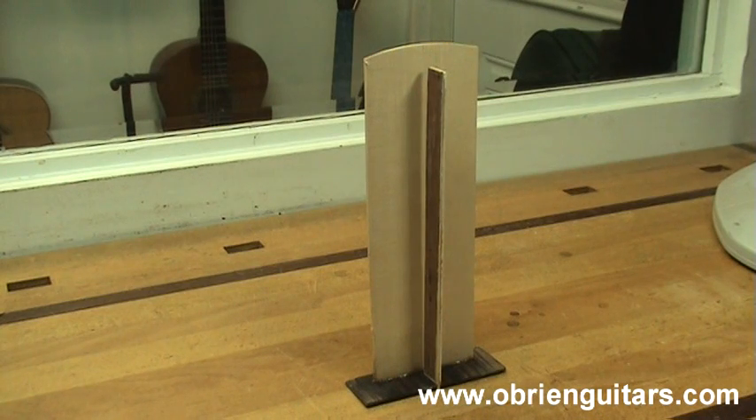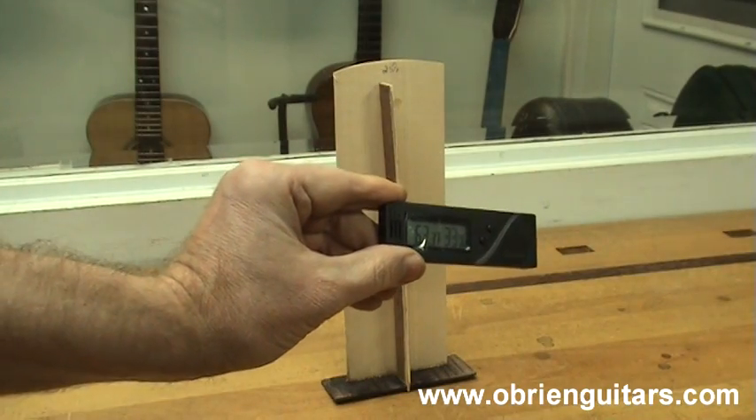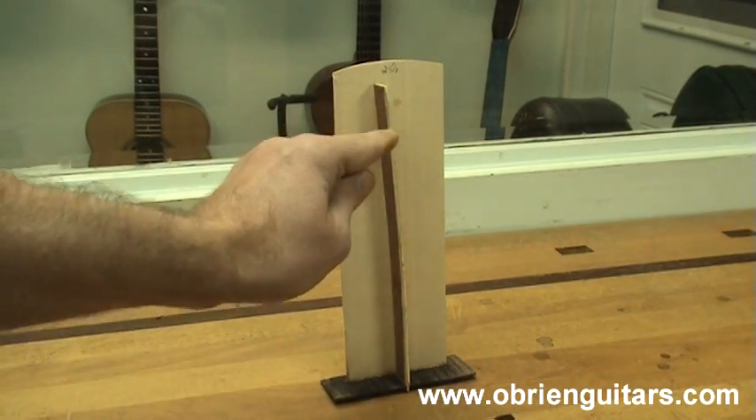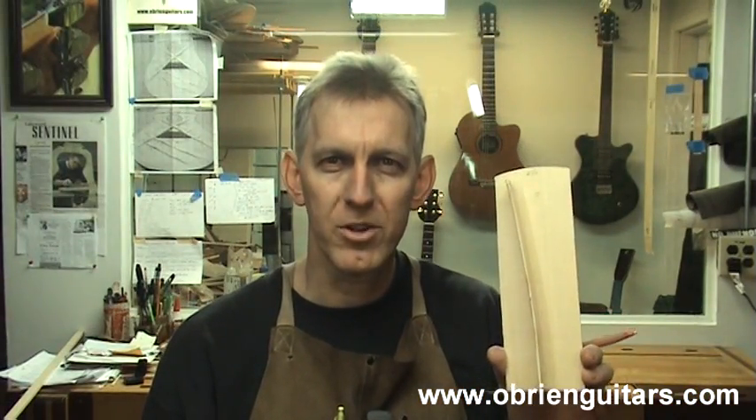If you wanted to, you could even make yourself a little stand to help hold your hygrometer. If you have a hygrometer in your shop, you can even use that to calibrate your homemade hygrometer by making marks on the stand. So this little tool could become one of the most important tools in your shop — it will help you know if there's a change in relative humidity. Take a look at your homemade hygrometer when you join your backs, brace them, voice them, and install them on the rims, and make sure the indicator is relatively constant when you do those steps. If you do, I think you'll avoid future problems.